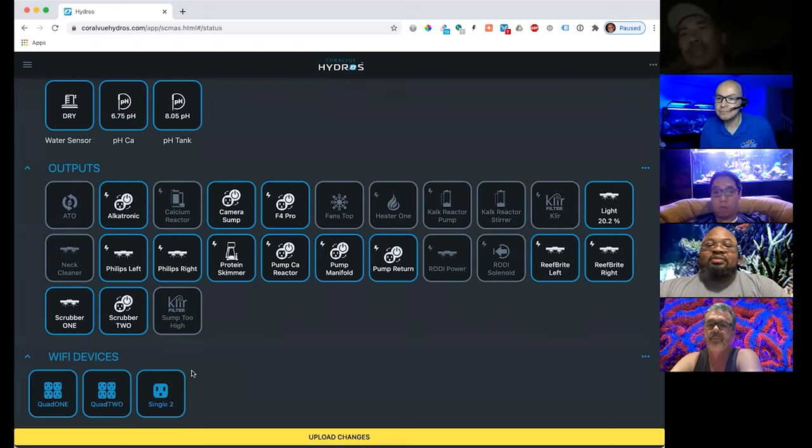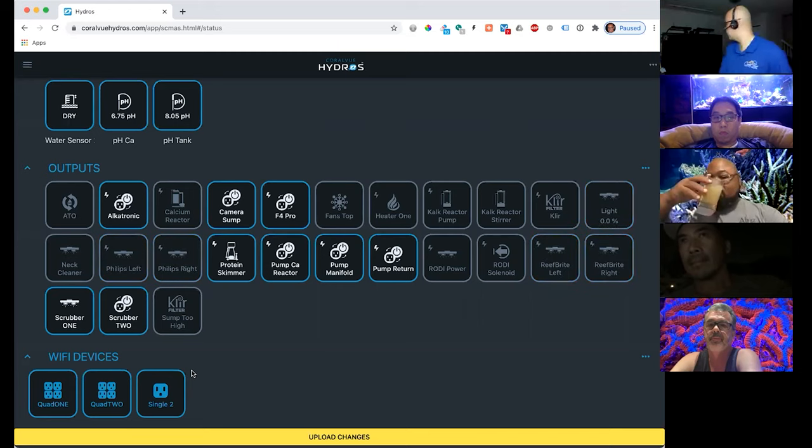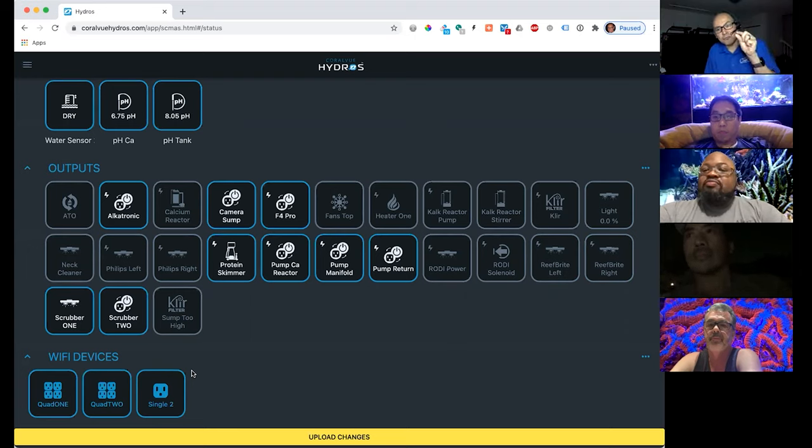Anything with salinity, please? We will have something with salinity, but we're working on that. The reason why is because we don't want to use a salinity probe. They don't work. We don't want to use a salinity probe because they get interference. There's so much noise. You're expecting this tiny little voltage to be completely inert from any noise. So what we've done is we actually have a working model of a salinity device that will read salinity